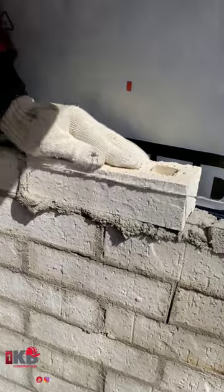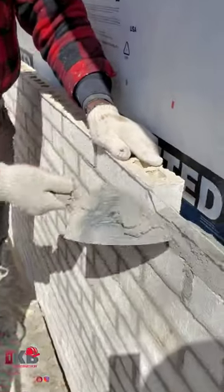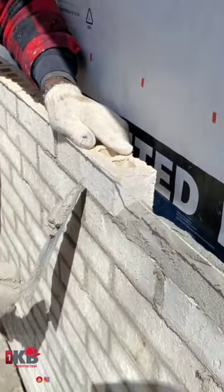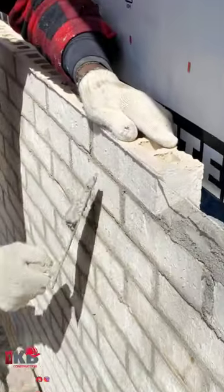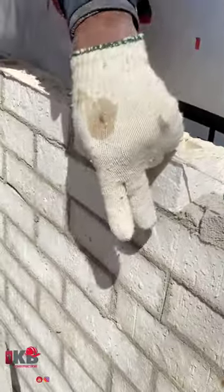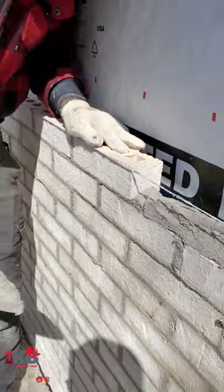So always look over your line just to make sure both bricks are in line. Once they're in line, you just bring it down. It's very important to match the new brick with the existing brick that's already laid. When you clear like this, both bricks are supposed to flush with each other. That way you know you're maintaining a straight wall as you go.